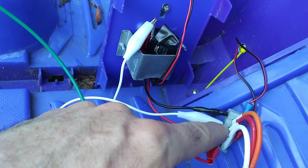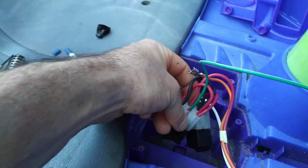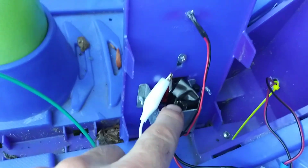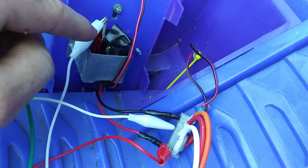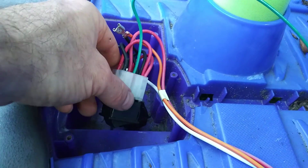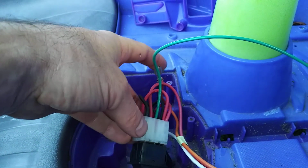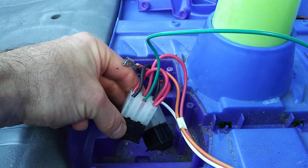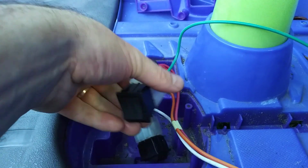Okay, so I'm changing wires around. This used to be red, used to be positive, now it's ground. And then I moved it to a different position. I guess I could have taken a wire from black, which is positive, coming out of your switch here, out of your trigger, and just tapped it into there, and then run a wire from here. That's probably more efficient too. So the only thing you have to depin is this guy. Pull this out, get it out of the way, just keep it as a union, and then in its place you would run this. And like I said, it doesn't really matter what direction this goes in, because you can always flip this around inside of the gear shift. That's no big deal.